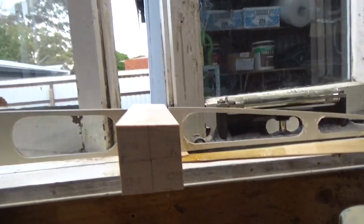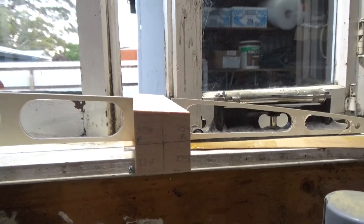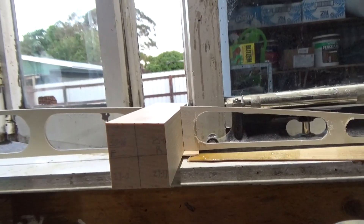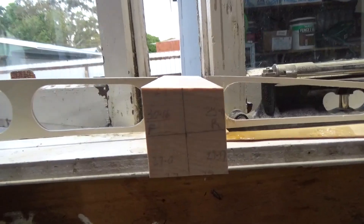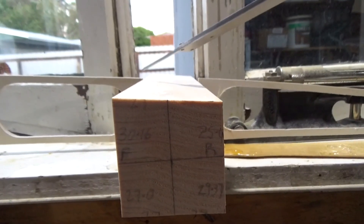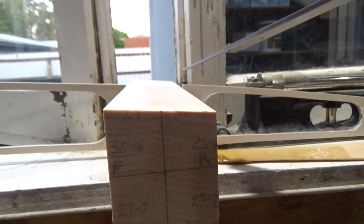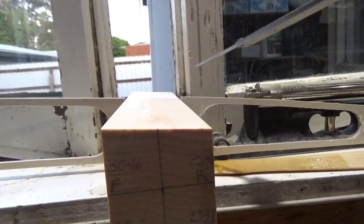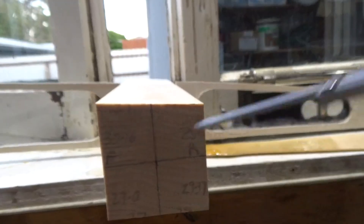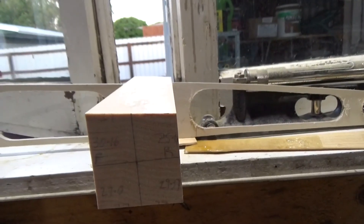What I'm going to show you now is where I'm at with this. With a bit of luck you can see the measurements on the end. I've got leaning up against it the centre web and also the trailing edge web. What I'm interested in at the moment is the height — I'm trying to get this down to a level between that and this, which should be 1/16th of an inch, and that and this, which should also be 1/16th of an inch. That's clearly a bit more — probably twice that — which means I've got a measurement out somewhere. It's either in the trailing edge or it's here. So I'm going inside, I'm going to have another cold cider, and I'm going to check my measurements and see which one might be out.